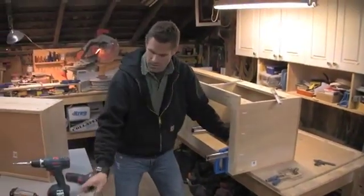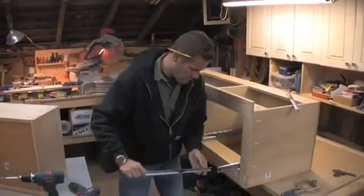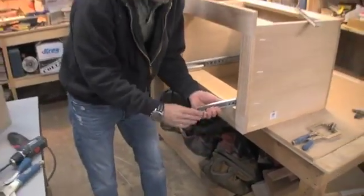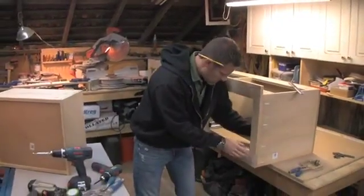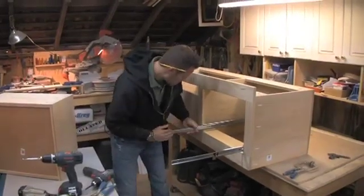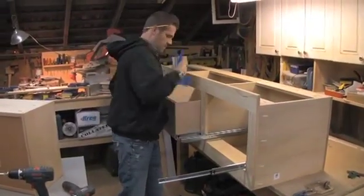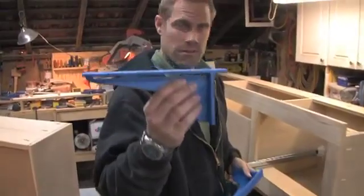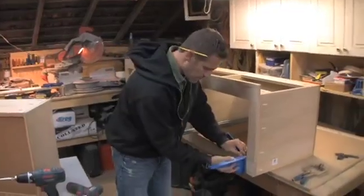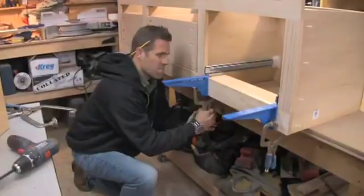Okay, so now our drawer slides are installed on the box. Cool thing is we can take our runners, run them right back in again. These would normally get attached to your drawer box. So we can just put them back on, because this is where it gets even more fun. This next thing, they're nothing more than supports. So all they do, this thickness here is the same thickness as the other jig, slides up underneath, we clamp it in place like that. Whoop, okay, so that's clamped.